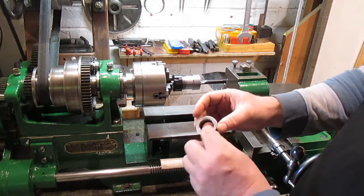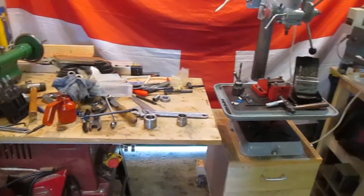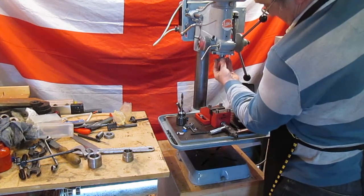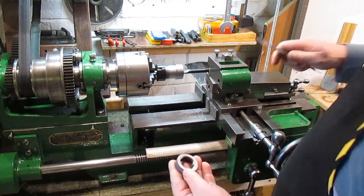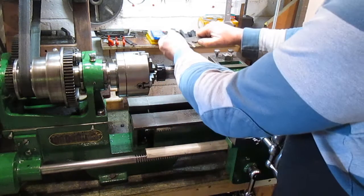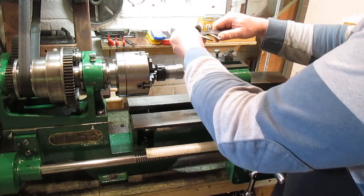This is the thread in here that we need to replicate. This is the nut that goes on the bottom of the coil, and that's where I want to screw this collet on to chuck onto. So I want that internal thread — and that looks exactly one inch.